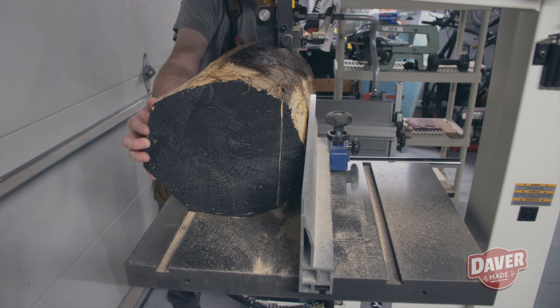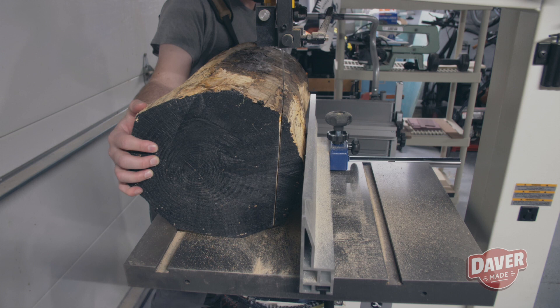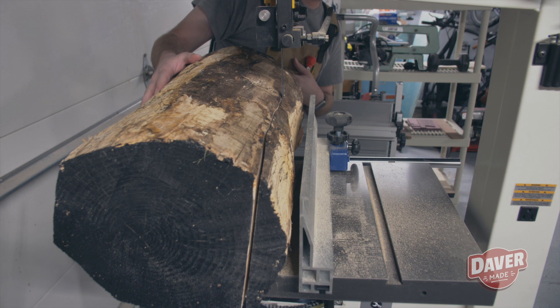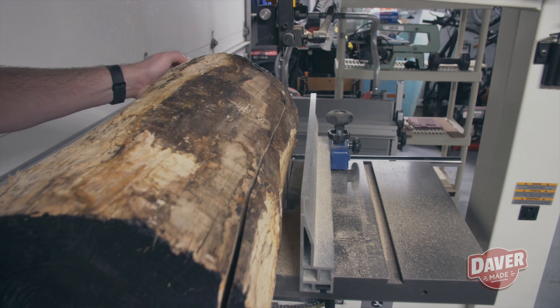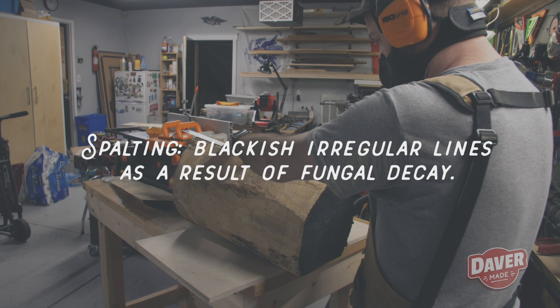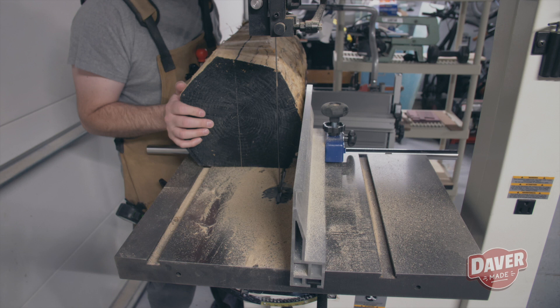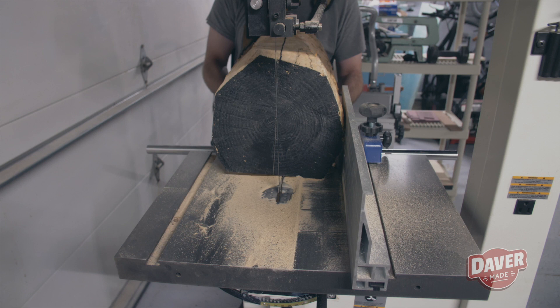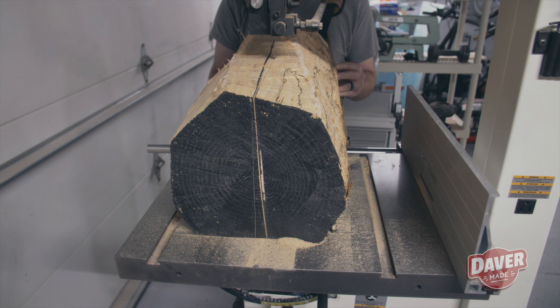As you can see here, the log was turning and the blade was wandering and I got some really bad cuts at first. I'd be lying if I said I wasn't getting nervous at this point, because I thought there was some really cool spalting and figuring in this log and I really wanted to at least get a few pieces out of it. Here's the cutoff piece which shows that spalted wood — it looks great. I definitely was getting in too deep and probably should have taken a moment. So I decided to cut this log down the center, or as close to center as I could, and I did not get a really good straight cut, which just made more work for me and potentially lost some volume of wood that I wish I would have had. I'm just creating some waste at this point, so don't do what I did.